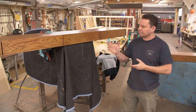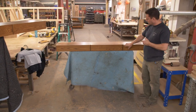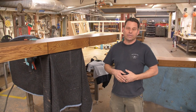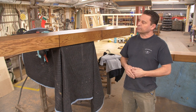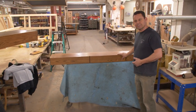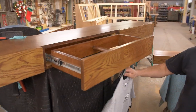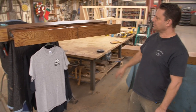So I finished up the fabrication. The drawer fronts went on, and the static shelf I made to look exactly like the drawer fronts — just left a little space here and there. I cut all these out of the same piece of wood so I could keep continuity with the grain, and I did that on both. It turned out really nice. We gave it a good sanding up to 180, then stained it with Minwax English Chestnut, rubbed that off, and clear-coated it with a nice satin polyurethane. I like the way the grain runs together and the fact that the two shelves look the same. This one will stack above the other one in the laundry room. Just pull these out, hang your laundry on there — I think it's a really cool look, really cool idea.